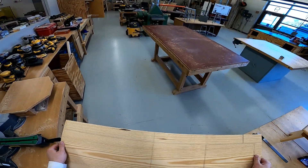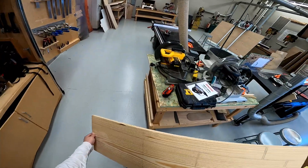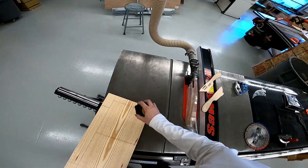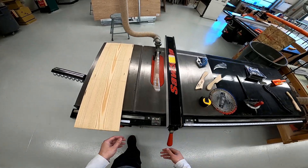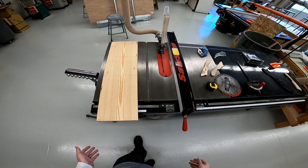You're going to take your board and bring it to the first table saw over here. Before we turn it on and make our cut, we're going to check a couple of things first to make sure everything is set correctly. First, obviously we're clearing stuff off. Second, we're going to lift this guard up, which is okay to do as long as the saw is not running.